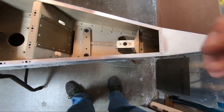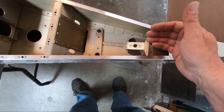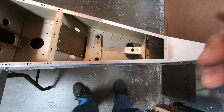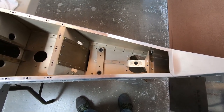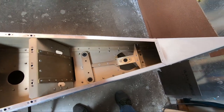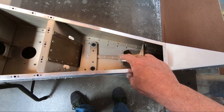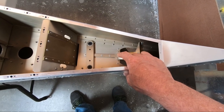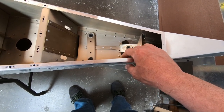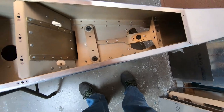I really couldn't find any other options — I can't get a bucking bar in here and I don't want to damage anything trying to put solid rivets in. The other option was to use three-millimeter rivets, but three millimeters would ideally be replaced with a number 5 bolt. Aircraft hardware basically comes in numbers four, six, eight, and ten — they don't really have the odd numbers in between. The closest I can get is a number 4 bolt, which is about 2.85 millimeters — just slightly smaller. I think it's a good solution: go ahead and install bolts with lock nuts on them.